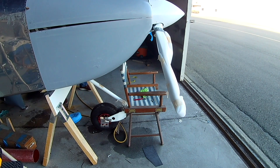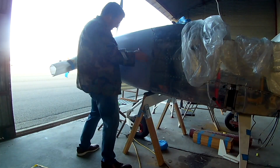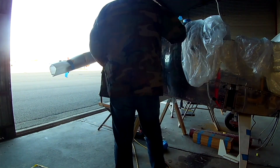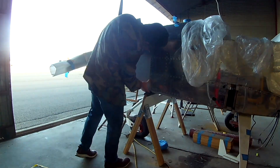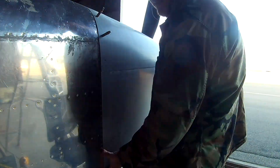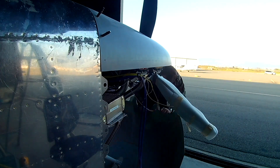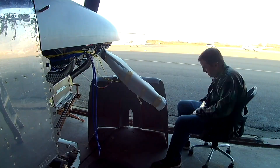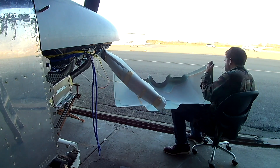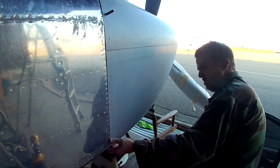The nice part about that hinge is when you narrow the legs together, it actually rises up. So combined with a little folding captain's chair, it's easy enough to put that sawhorse right behind the line where the fuselage is — just aft of the camlock flanges. You simply lift your bottom cowling into place between the sawhorse and the fuselage, bring the chair over to hold it as high as it can, then walk around the side and pick it up the last four inches. To remove it, you do the whole thing in reverse — put the chair in place, pull the cowling out until it wants to sag, let it sag on the chair held in the back by the fuselage and sawhorse combo, then put it right back on.